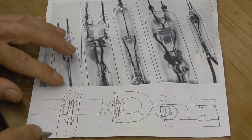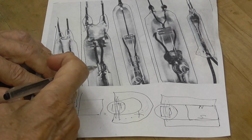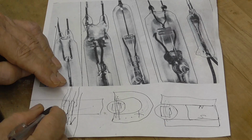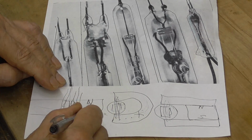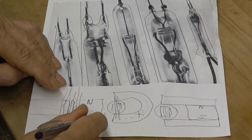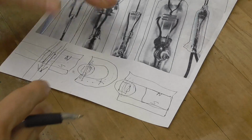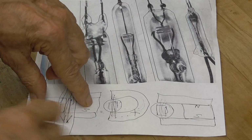Now the other type of magnetron, the plates are placed parallel to the axis of the tube, and then you put the magnet, which would be a like so, with the pole pieces like that, and the magnet would be surrounding the tube, and it could be even a coil of wire.